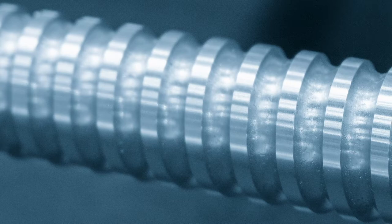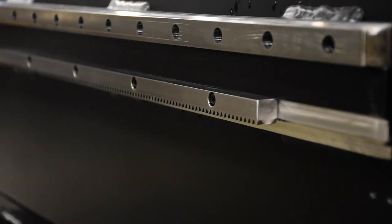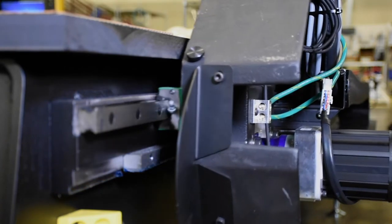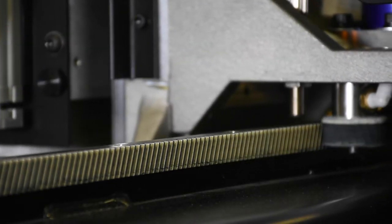We discussed complications of ball screw maintenance, whip, and what it takes to get a ball screw aligned properly with yaw, pitch, perpendicularity, and parallelism. Upon completing our discussion of Multicam's 4-foot to over 40-foot moving gantry machines, he expressed that the ball screw had no benefit over helical rack. He felt strongly that within our industry, the helical rack is more forgiving, easier to maintain, while providing smooth and accurate motion.